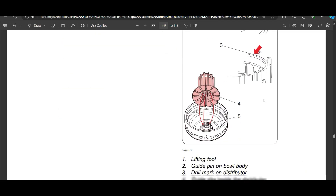There's a right way and a wrong way to install the distributor. The bottom part has three recesses in the shape of a Y, but they are not at equal distances from each other. So if you don't put it in correctly, you might end up damaging the distributor when you tighten the disk stack.